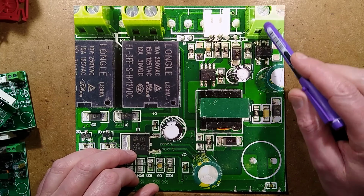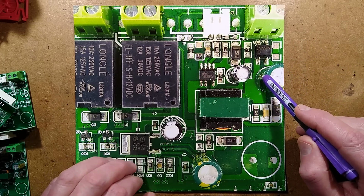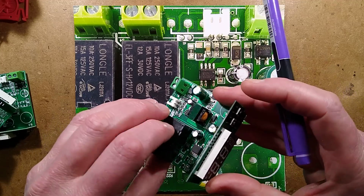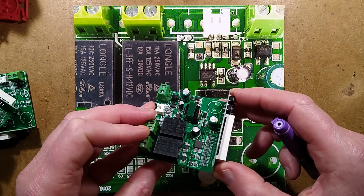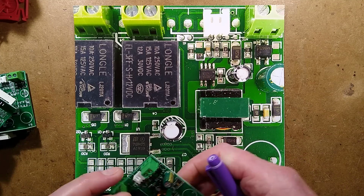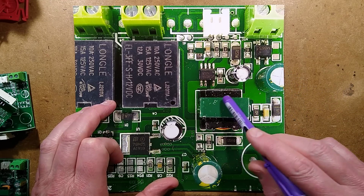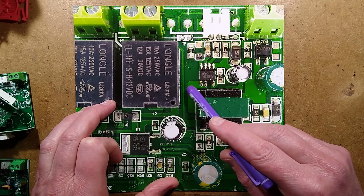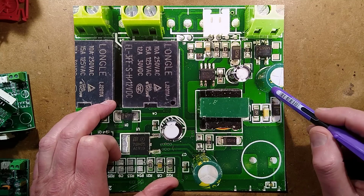So the supply comes in here and it goes straight to the bridge rectifier. Then a smoothing capacitor rated about 4.7 microfarad, 400 volts, I think it is, which is a Changzin capacitor. Yeah, about that. It's hidden. Oh, 4.7 microfarad, 450 volt. That supply, the positive then goes to the coil of the transformer, the primary, and the negative gets switched with this switching chip. There's a little snubber network across it, just the usual setup.